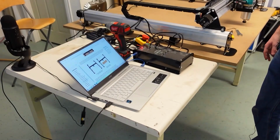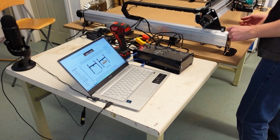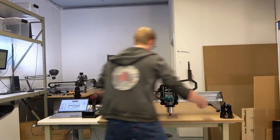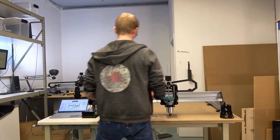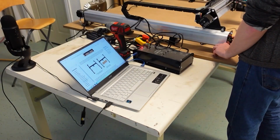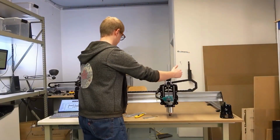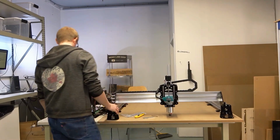The other way you can do it is, I don't think I have a measuring tape near me, but you can run a measuring tape from the underside of the rail to the opposite foot using those edges on the feet. So you do it on the one side and you do it on the other side, and those measurements should both be equal to each other. If one of them is larger than the other, so let's say the measurement from this diagonal is larger, then that means I need to move this foot inwards further so that it reduces that measurement and increases this measurement. For those diagonal measurements, you might need a partner to help you out. So just get their help if you need it.